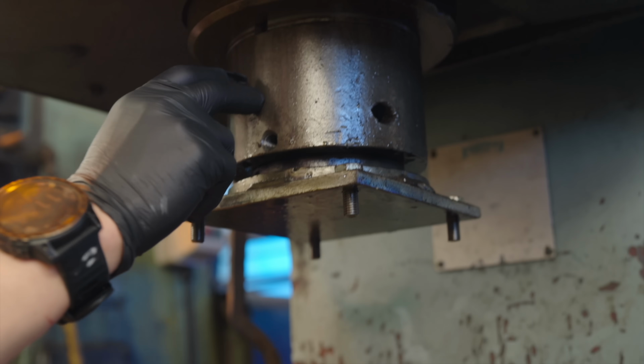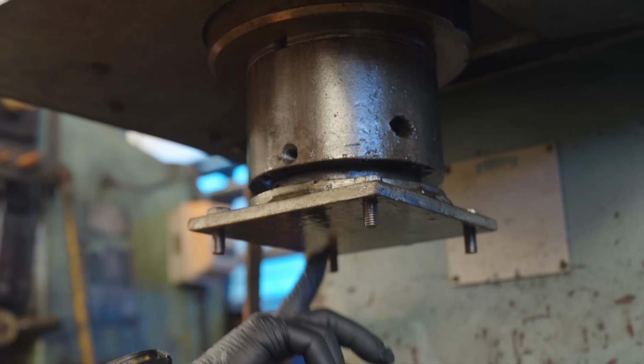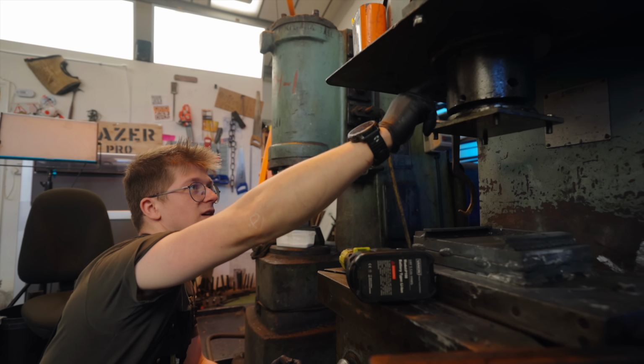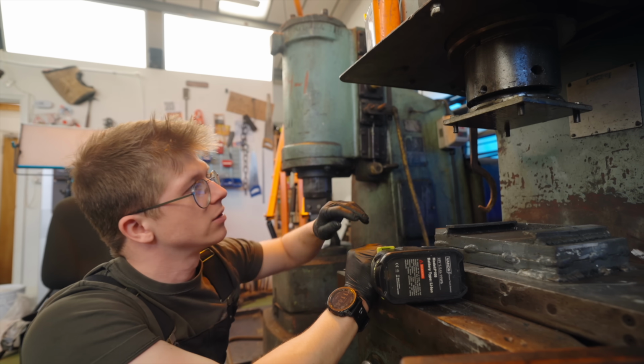But for actually using this as a punch press, effectively, you need access to the bore to make a nice setup. There's a hole inside that ram where you can put tooling up under. I could just make it on a plate that goes there, and that should be fine.